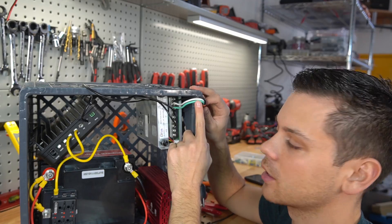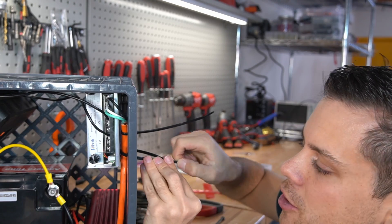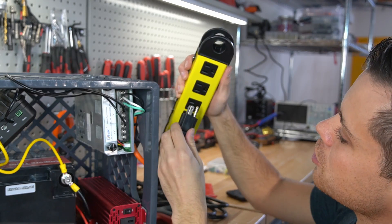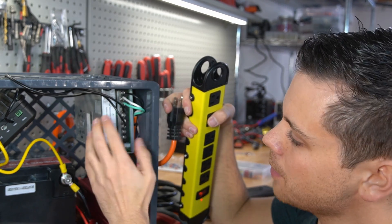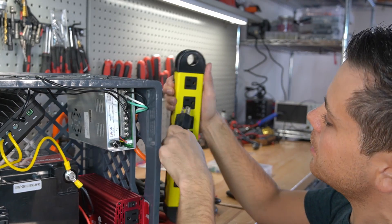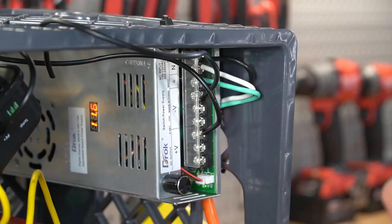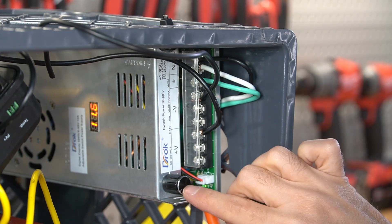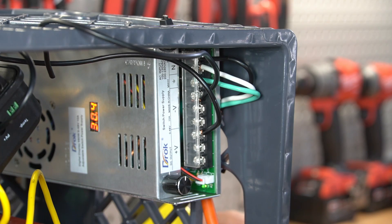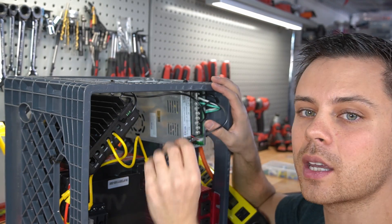This is a high-voltage conductor, so we need to secure these wires so nothing can yank them out. Use a zip tie to hold the extension cord down to the milk crate, and use multiple zip ties to ensure there are no issues. You can add a longer extension cord if needed. Now we're going to plug into a surge strip to program the output voltage — ensure the output is not touching anything else. Plug it in, and now we have power. The output voltage reads 11.6 volts, so rotate the knob until you hit about 30 volts. Power down the supply and wait until it powers down all the way, then connect the final conductor: V negative to PV negative.